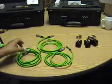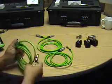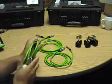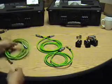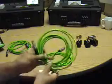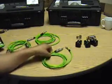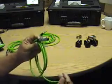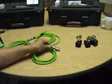These are the probe cables. This is the 11-pin to 11-pin that will be used with the mechanical impedance probe. This is the 11-pin to 8-pin probe that will be used with the pitch-catch probes, and this is the 11-pin connector that will be used with the resonance probes.